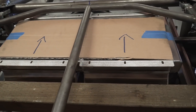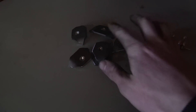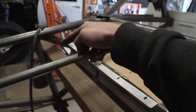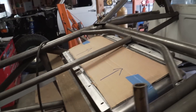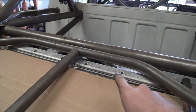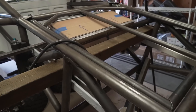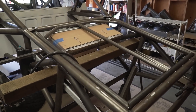Right now on this side I'm going to use these trick tabs that you've seen me use before. I'm going to run a piece of one-inch tubing along this, probably off of the main bed cage, and then run the tube across. On the top side I'm more than likely going to run a piece of plate — drill some holes in it and just run it to this main tube underneath the trunk lid. Shouldn't be too difficult. I just wanted to update you guys because we are getting somewhere with this trunk lid.